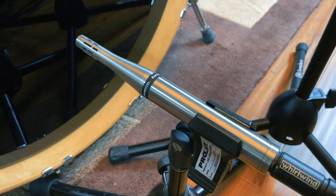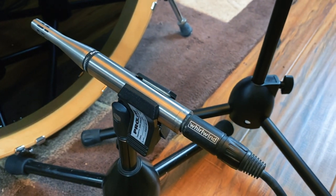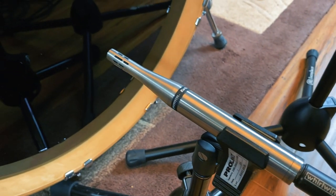There's also a myth about diaphragm size and being able to pick up low frequencies. With dynamic mics it's true — if you have a larger capsule or larger diaphragm it'll pick up low frequencies better. But with condenser mics it's not necessarily true. So don't be misconstrued about the small capsule on this mic. This has a frequency response of 20 Hz to 20,000 Hz, a cardioid polar pattern, and a max input of 150 dB SPL.